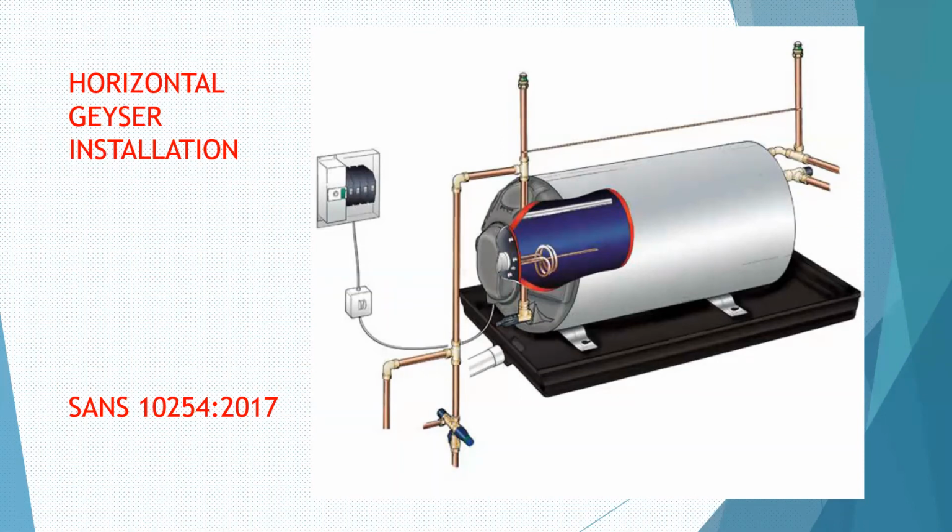Now you've got to prove to this lady what is going on here, because you would like to explain to her why that water is running from that valve. So you say to her, ma'am, I'm going to open up the little doors of your cabinet at the bottom here. And if you are, once again, a fortunate plumber, you're going to see at the bottom, inside the cabinet, there are 2 angle valves. The one on the right-hand side, obviously, is the cold water to the mixer. We assume now it's a single lever mixer. Well, we have said so. And there's going to be a cartridge inside. So you close the angle valve on the right-hand side, feeding the cold port of that mixer. You close it, not the outside one, the one on the right side, the cold one.